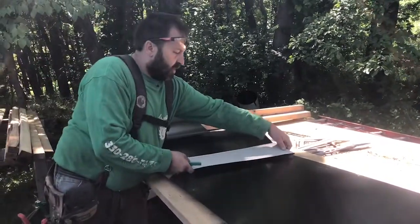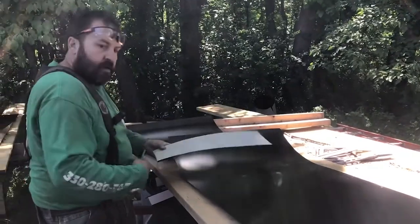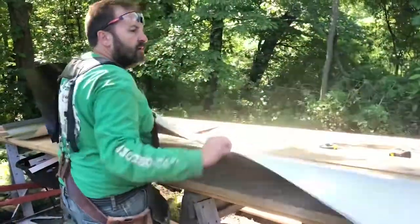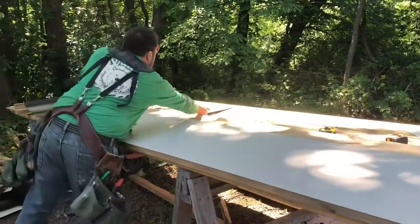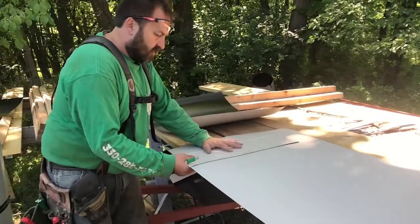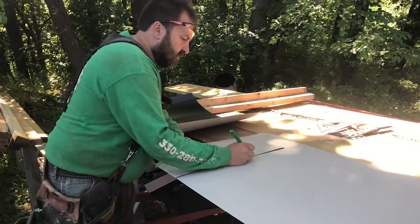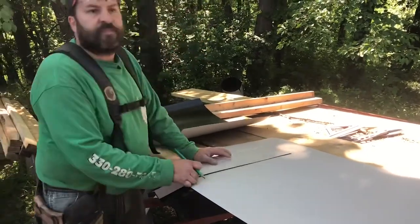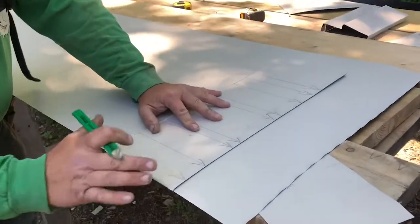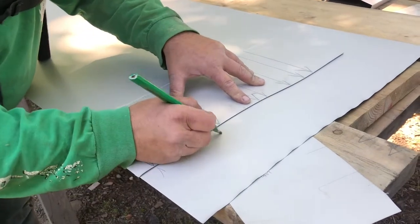Now flip it over. When I flip it over, I have to keep in mind which edge I hooked on. So when I flip this sheet, now I need to be hooking on my belly side when I make these next measurements. Now we hook on belly side, make sure it's tight, square, crow's foot. Other end. If you're going to use this jig, it's very important that every time you're staying tight, staying consistent. You really pay attention to every little detail.